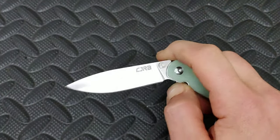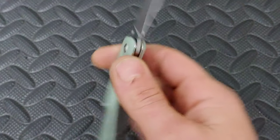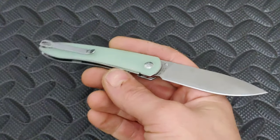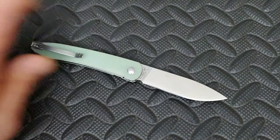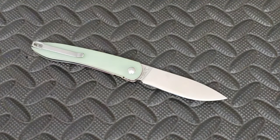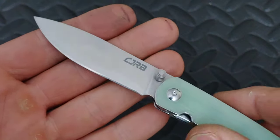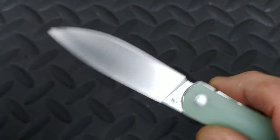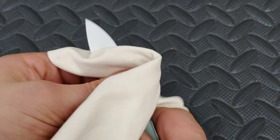It does get down to a relatively thin edge — I measured 15 thousandths at the thinnest portion. I would guess this had a little bit of a burnt edge, and number two, the grind is off just a little bit. I tried to match it up as good as possible. Let me clean it really quick and I'll try to get some close-ups of it.